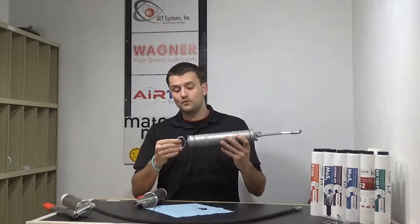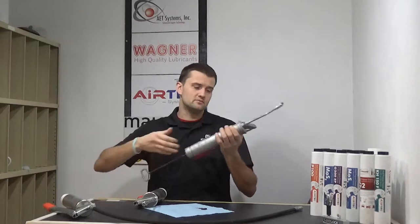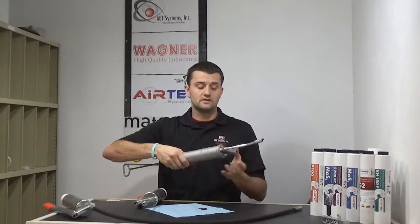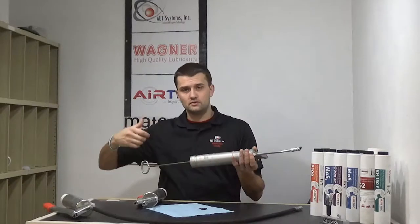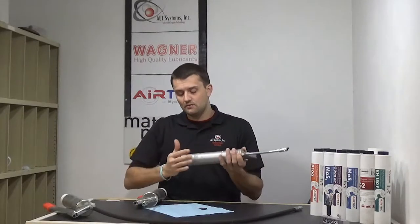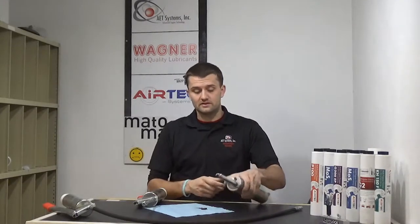When we start looking at grease guns, right when you come down on the diagram, you're going to see a split between two different styles. You're going to see the old standard style — the grease gun your dad had, his dad had, and his grandpa's dad had. It's very simple. You're going to have to pull back this plunger every time you want to change a tube. You're going to have to unscrew this outer tube here to get at the reusable cartridge inside, pull that old tube out, put a new one in, untake the cover, and then screw the main container back in.